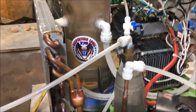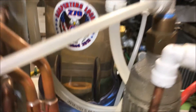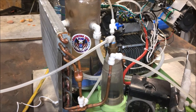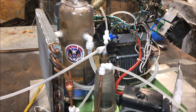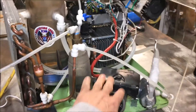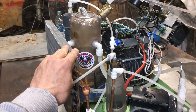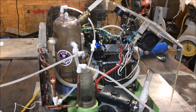It won't do — I need at least 25 watts. But at any rate, we are going to observe the effects of turning this thing on while the torch is running. I just want to mention that I'm not doing this thinking something amazing or strange is going to happen. The only purpose I'm using this ultrasonic transducer is for the consolidation of micro bubbles, because I want to reduce entrained flow — nothing else. I'm not into any of that crazy HHO stuff. I want the torch to work good and I don't want bubbles in my radiator, because that reduces the effectiveness of the cooling significantly if the entrained flow becomes significant.